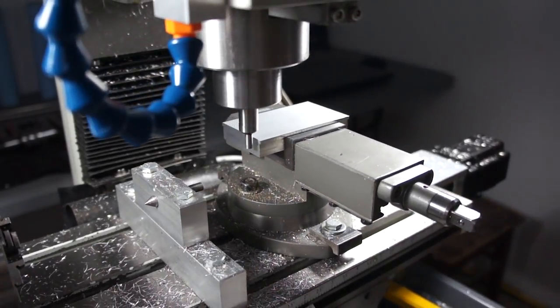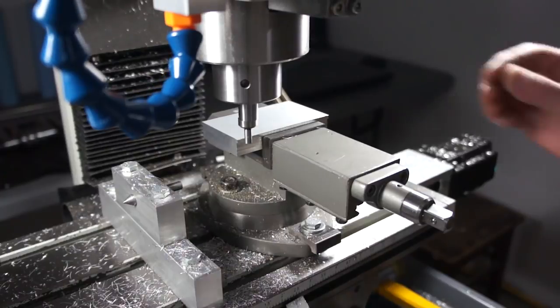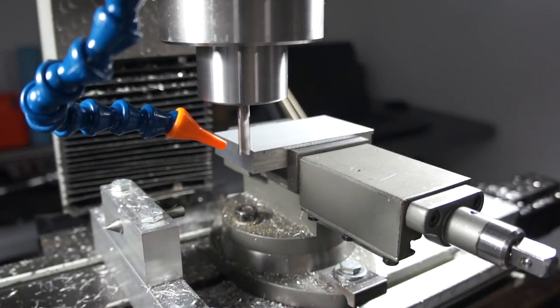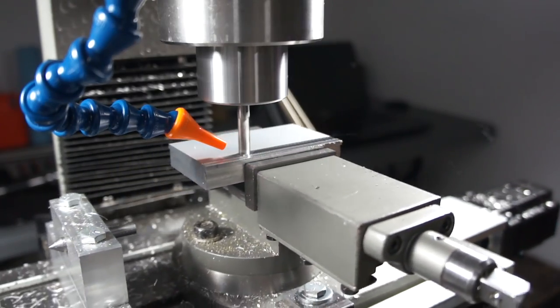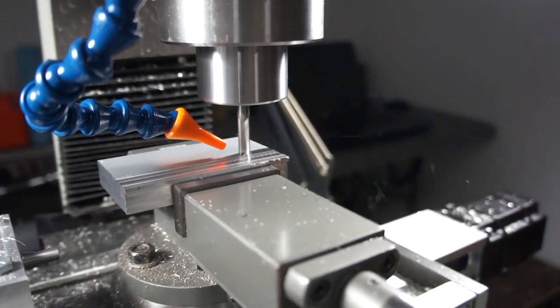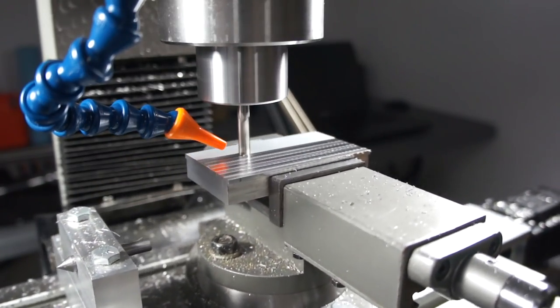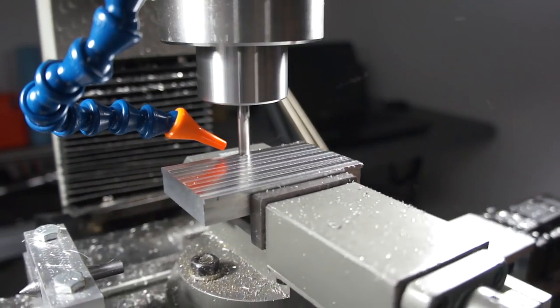The first step was to use the edge finder to indicate the edge of the fixture — I milled all the surfaces so I could do this. You can also see some steps on the aluminum fixture plate which I use to pound it into the vise and use the top of the vise as a registration point. Next we're going to use a quarter inch end mill to take the top of the rough stock down to size, clearing up any inaccuracies from the raw material. This also helps because we're going to use the superglue and tape trick, and a nice flat surface works best.